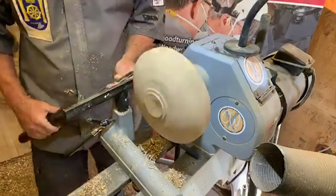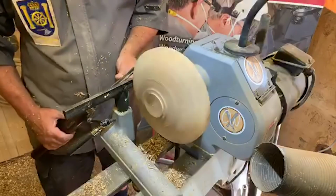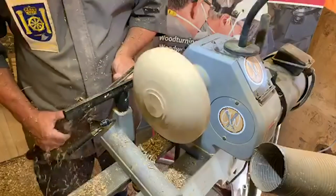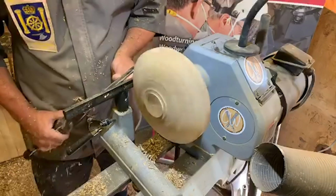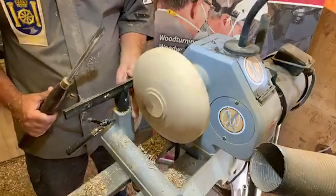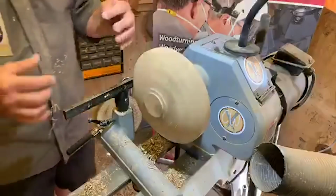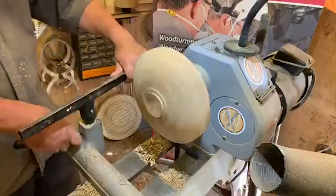And on my finishing cuts, I'm just dropping the handle a little bit further and rotating that flute inward more, so we get generating almost like a skew cut. It really works well on those bits of end grain. There, I'm just checking to make sure we're there, and that's enough. So now we can start thinking about our final shape, but also getting a nice finishing cut.